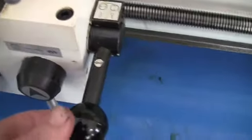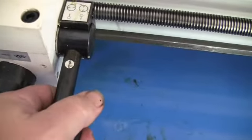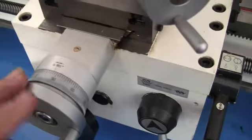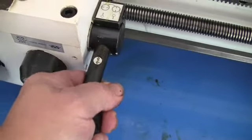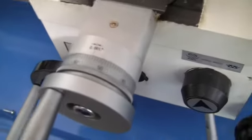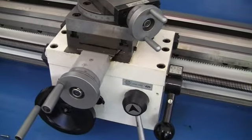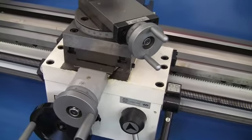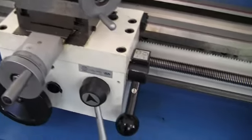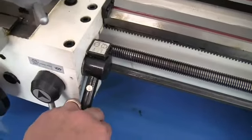And like I told you, how this works, you rotate this handle around, okay, like to there, and it locks in place. And it's showing you the direction it's going to feed the cross slide. And one of them goes one way. The cross slide goes down. When you depress it down, the handle starts to move. And like I said, I ain't got nothing rapid. You can adjust your speed. It's thousandths per revolution. Okay, then to disengage it, you just pull back and up.